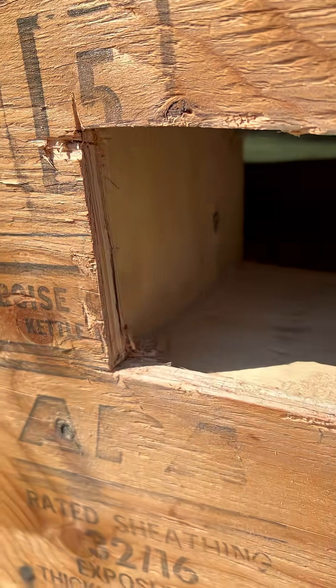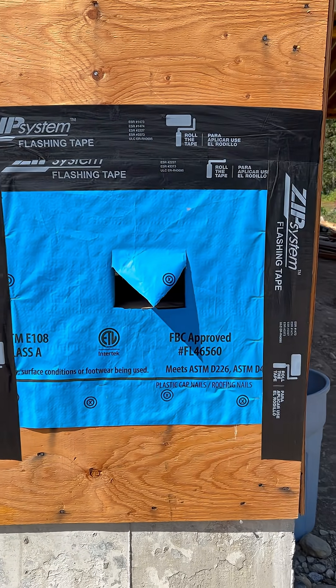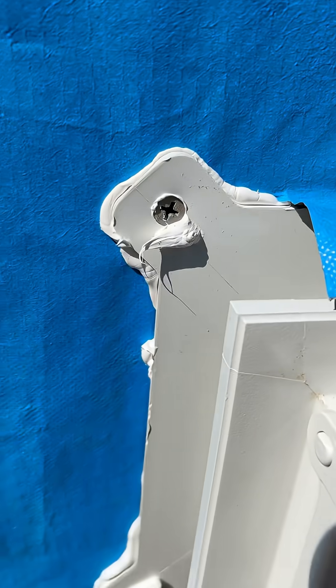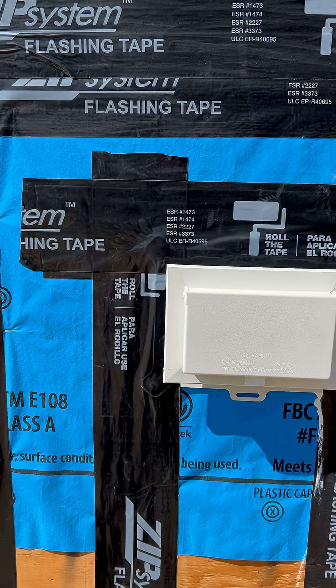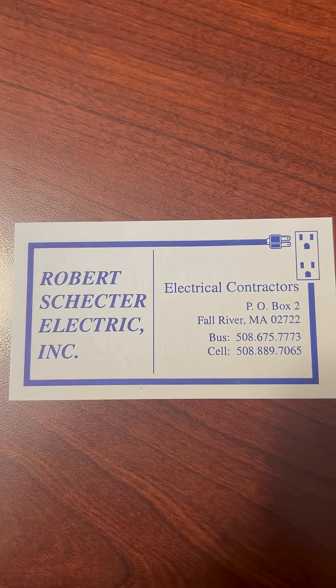I had a lot of questions on how I actually install these outdoor plugs, so I'll take you through it. I flash everything with Tyvek, I zip-tape everything, and a lot of people ask what I do with the top of the flange. I cut the top of the flange and fold it over the actual plug itself, so all the water that hits it will go on the flange around the plug and not inside the building.